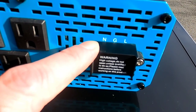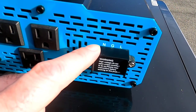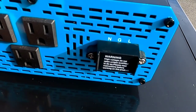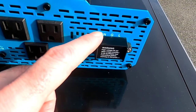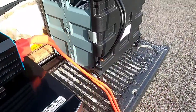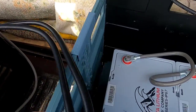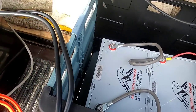The inverter has a USB output for charging phones, three AC plugs, and screw terminals that you could wire directly into junction boxes in an off-grid cabin to feed wall outlets. Cheaper inverters don't normally have the hard-wired terminals, but on more expensive ones they do, so it can sit out of sight wired into your cabin's grid. On the back you've got the positive and negative terminals with thick connections that connect to the battery.